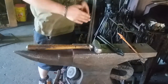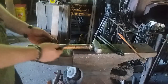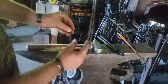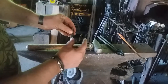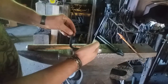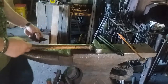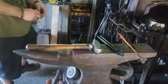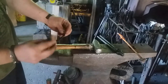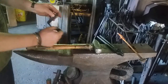It's a simple thing and you can do a lot of variants. Here's the basic hook — you want about two and a half to three inches at most between the point of the hook and the back plate, just so the ring has enough room to swing around and land on the hook. This is just decorative punch and chisel work. You can get fancier with your hooks — I did this one here with a little guillotine tool work to make it more interesting looking.